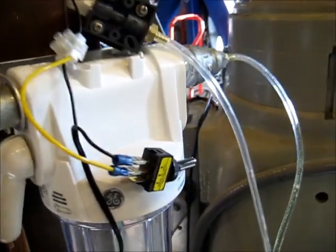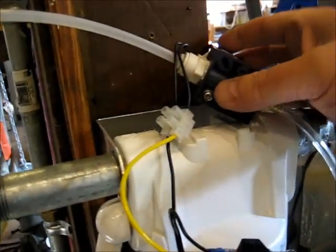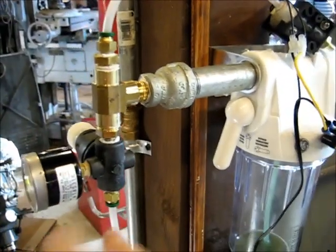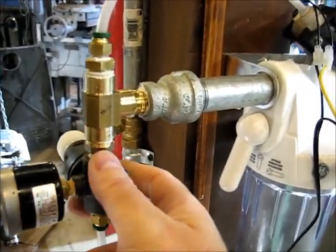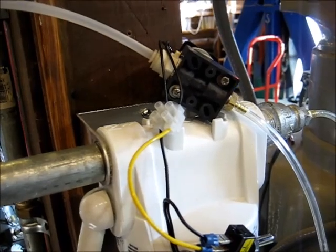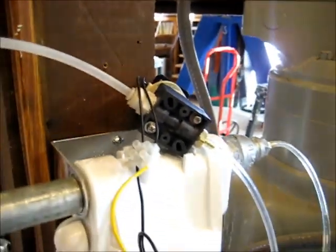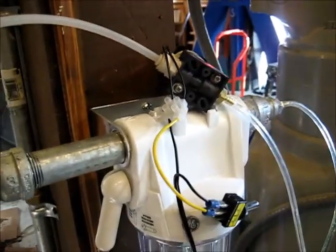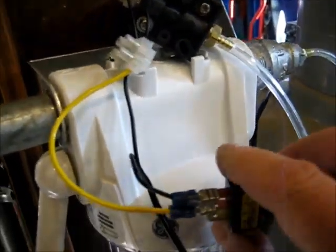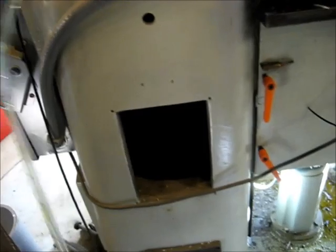Let me show you this little relay, this little 12-volt solenoid. I've got it on the back side of the pressure regulator. Honestly, I don't know what the pressure rating is on these things — I bought them 6-7 years ago for a different project and they don't say on there what they're rated to. They're plastic body solenoids, so I really didn't want to hit them with 140 pounds of air pressure and see them blow apart. So I've got this switch wired in and it gives me pretty much instant control.